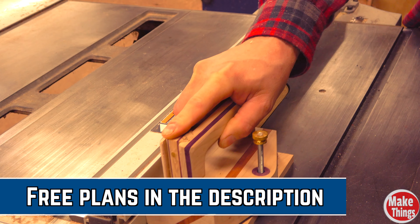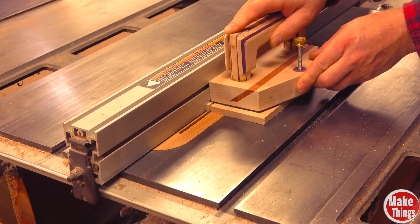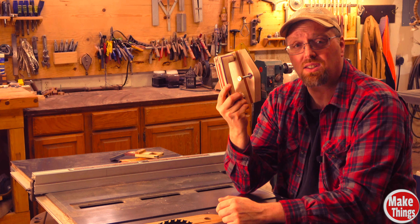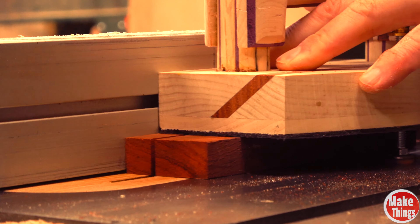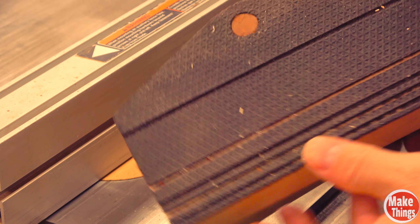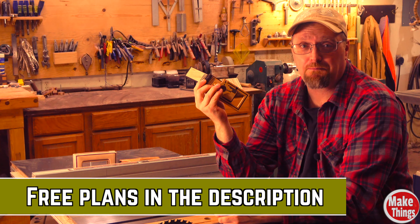In these circumstances I'm faced with two options. If the wood is shorter than about 12 inches, I have a push block with a rubbery base that I can sacrificially cut into. This puts pressure against the fence with a shorter length and I'm better prepared to hold the stock in place as I cut it. A bolt helps to stabilize the base relative to the thickness of the wood, and I can adjust it to keep it parallel to the table saw face, which further helps with accuracy and minimizes dangerous kickbacks. The downfall is that you do damage to the rubber pad, though it can be reapplied as long as you set your blade to only nick the rubber.